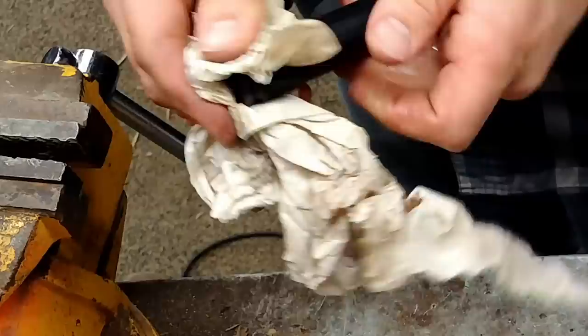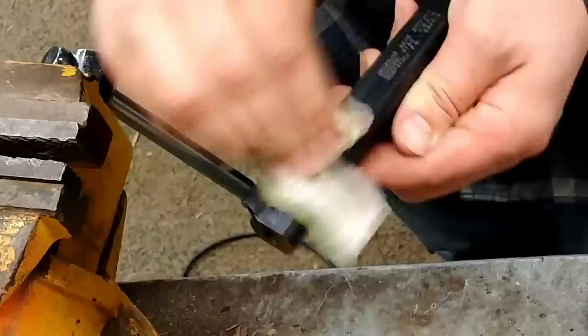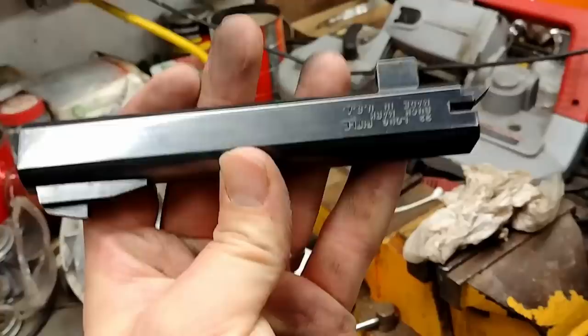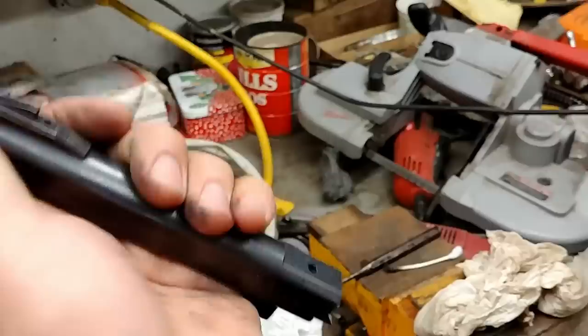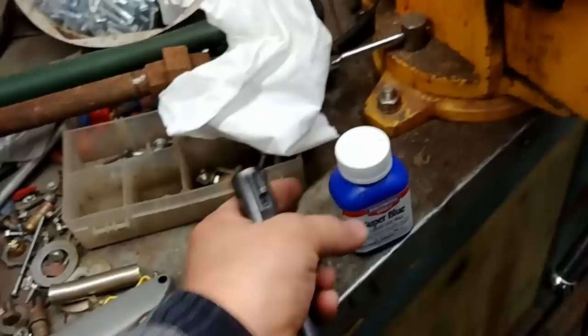This is what it looks like after rinsing it off again. It makes me kind of not want to use the steel wool on it because it's really nice and dark, but it's a little blotchy — and I think that's what the steel wool does, it kind of smooths out the blotchiness. Who knew that you could re-blue. So there it is, looks pretty good. Yes, you can re-blue stuff even if you've never done it before. Improvements would be to use a slightly larger applicator so it's more even, but once you buff it out it pretty much turns out even anyway. Link in the description to some bluing chemicals.